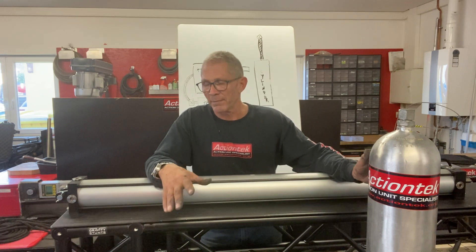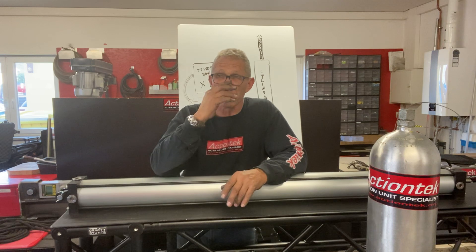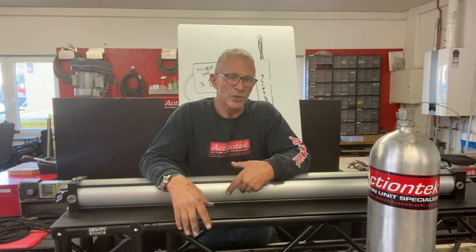You're using a force multiplier — something that can do more work than you — and using it for the force it can generate. We use ratchets for reactive shots and explosions, for people flying through the air, people yanked out of the way of a car. It can look like a car hit, or somebody getting sideswiped by a speeding car. There are a lot of ways to use this in the pulling fashion — they're reactive shots, generally that's what they're for. You can also use them to decelerate using the stroke and negative air pressure, but that's trickier and requires more math.